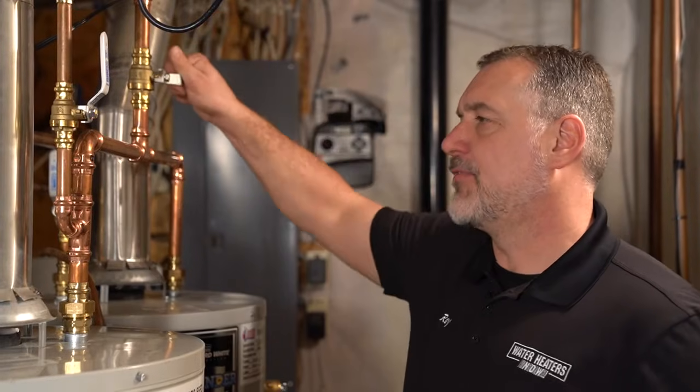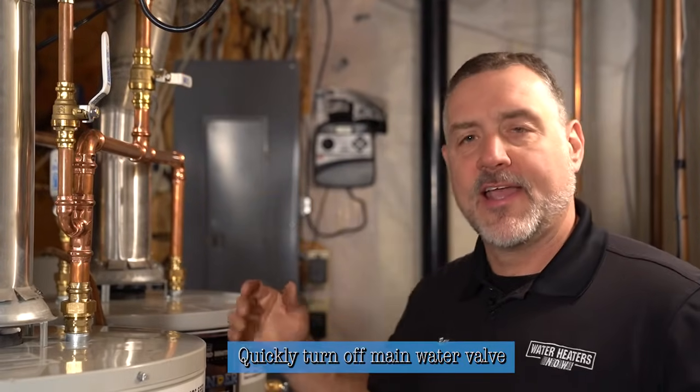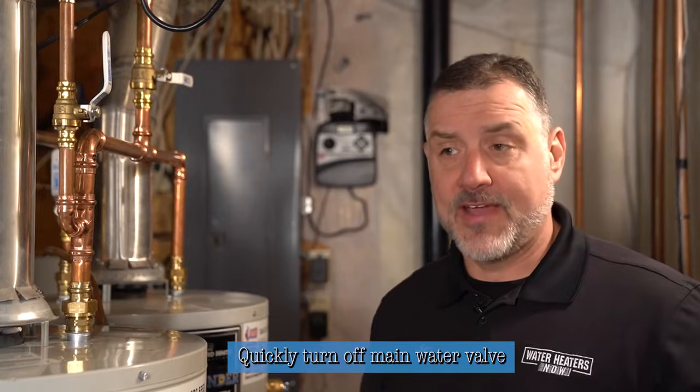Water is pushing out rapidly. After five seconds or less of pushing all the sediment out, we'll shut off the water to the entire heater and let it continue to drain by gravity, which usually takes about 30 to 40 minutes. You just walk away and let it drain, and then we'll show you how to continue the service from there.